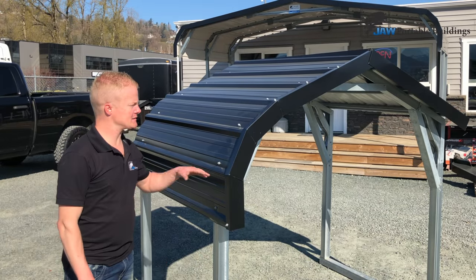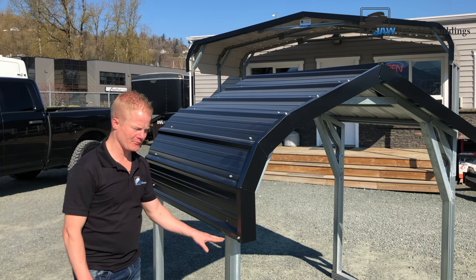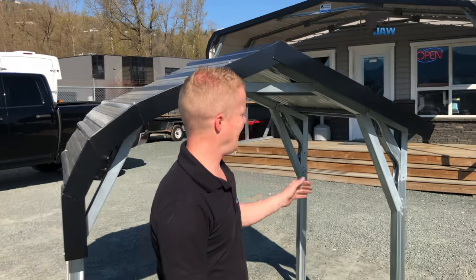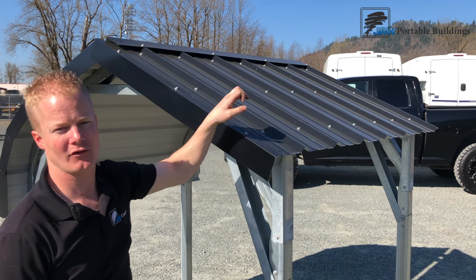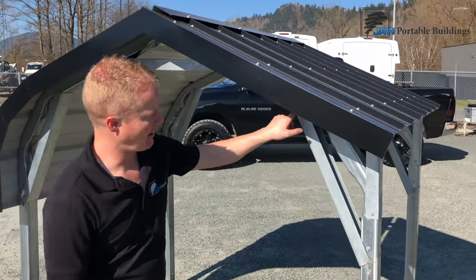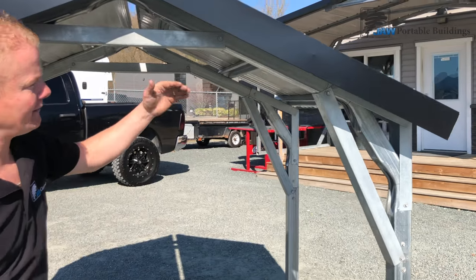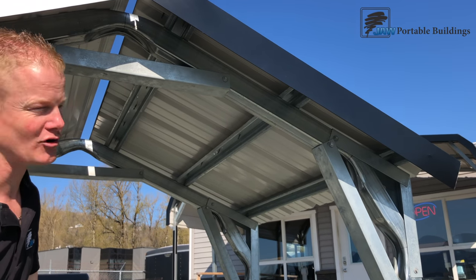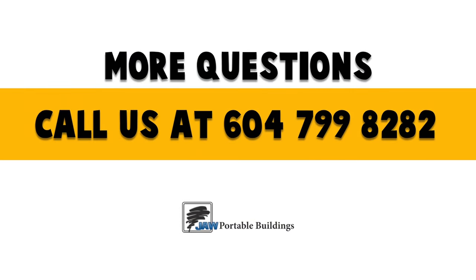The two different roof designs we've been explaining are the round frame and the A-frame style. On a round frame building, your metal wraps right around the corner and comes down about a foot on each side, with trim installed as shown in the earlier video. The other roof line is the A-frame style — the biggest difference is that the metal on the A-frame runs from your ridge down to your eave in the traditional way. There's really not much difference in installation; you'll have a slightly different rafter with a corner brace built in. The main difference underneath is your hat track, which supports your cladding — it's galvanized hat track strapping that hangs over 6 inches on the front and 6 inches on the back.